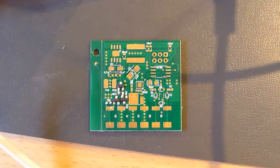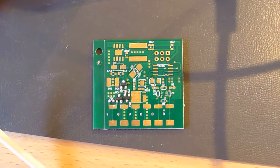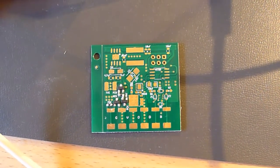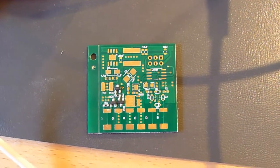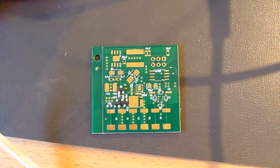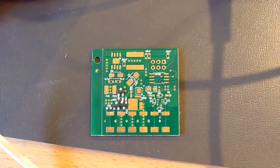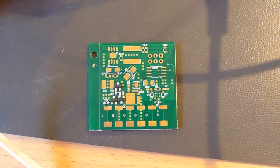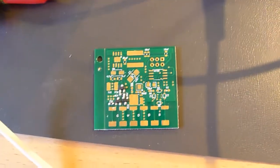The nominal max current for this device I've decided to set at 15 amps, though it would probably be fine at 20 or maybe 25. You're going to start to have some heat issues, so to be safe I would suggest never using a larger than 15 amp fuse, but if you want to try and you break it, well, that's on you, and that's fine with me.